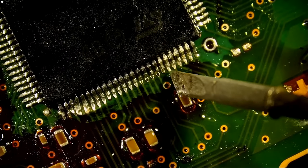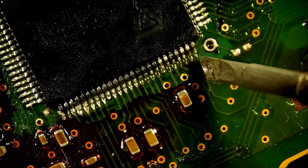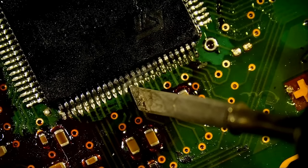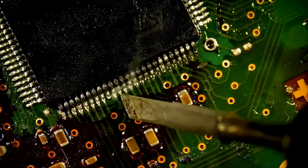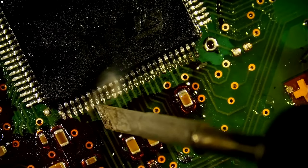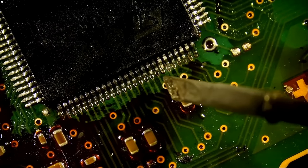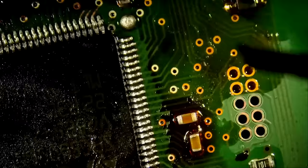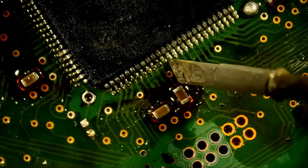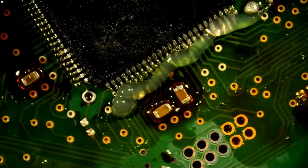And that's how we would solder pin by pin. Using the NF-Dot Mini pen, one of the most amazing pens that you can lay your hands on. It's amazing and awesome for tiny jobs like this. Just look at the precision on the tip. I mean, since we're making this side look like a mirror, why not do the rest? Just fly through it. But of course, we're gonna have to apply flux unless we are asking for trouble.